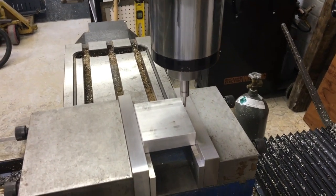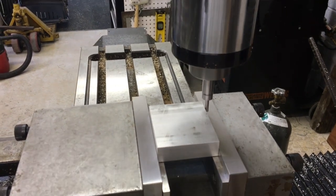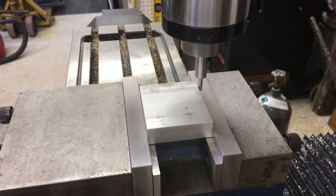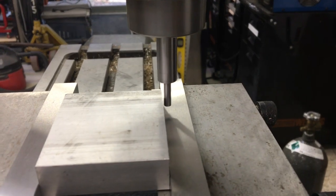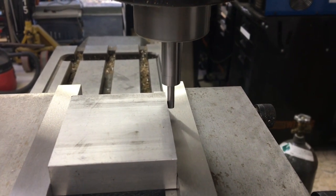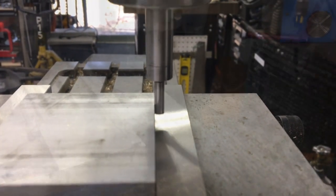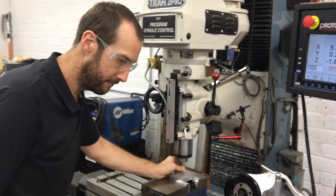Right there is where you would zero your machine, or add in Y positive one hundred thousandths, and that's your location for the Y position. I'll put in Y 0.100 and we'll go and do it again just to see what kind of results we get. Consistency — it's exactly the same on the readout. You got five tenths that time. Go a little slower; if you go too fast you'll overshoot it. So we're at one inch — it's very consistent. That's the traditional way it's taught to be used. I honestly stopped doing that probably about ten years ago.